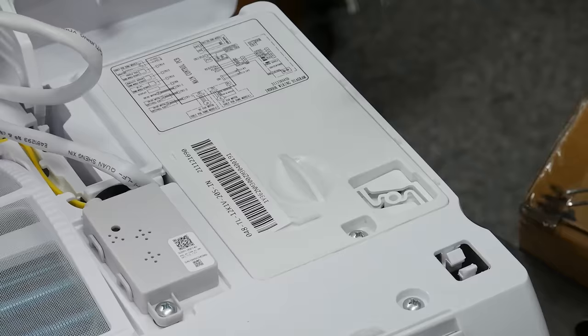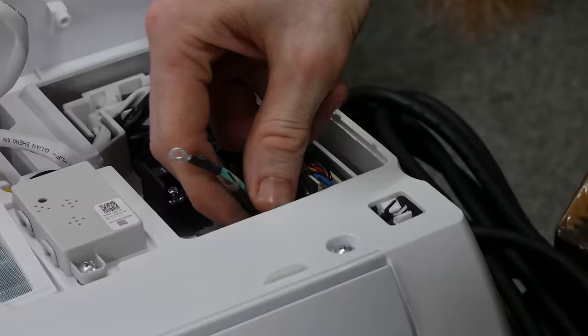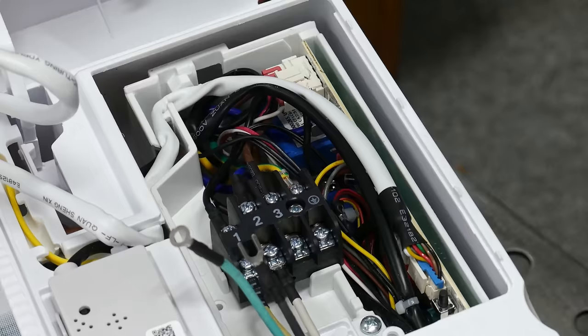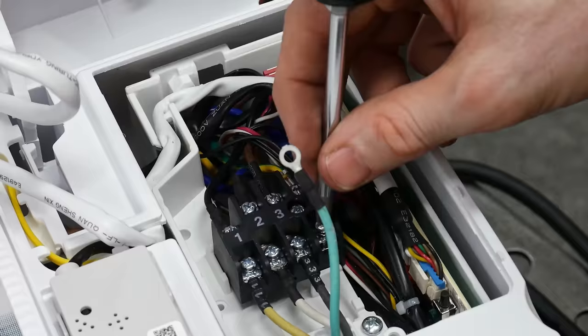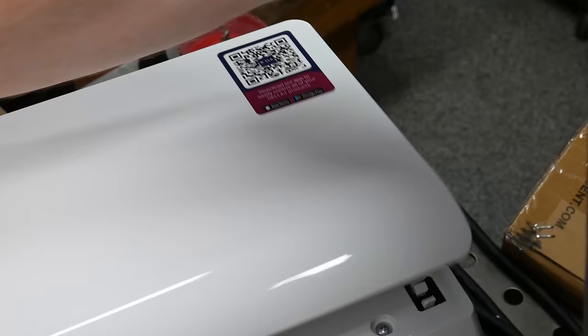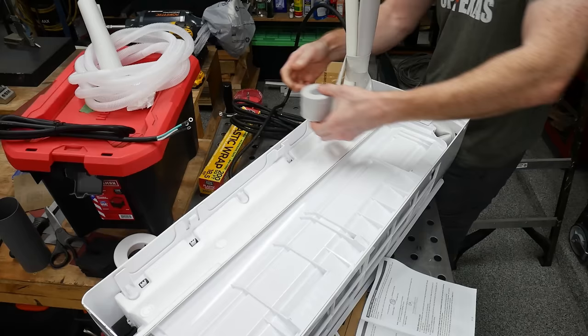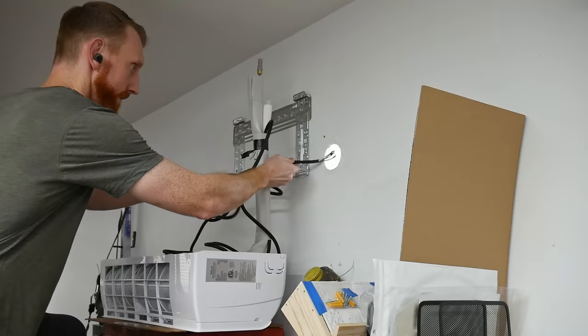Before mounting the wall unit we have to connect the wires that will run between the wall unit and the outside condenser. There is a wiring diagram on the front panel and the wires are labeled, making this a pretty easy task. The yellow wire goes to location number one, the white wire to number two, the black wire to number three, and the green to ground. With the inside unit wired, I carefully bent the refrigerant lines perpendicular to the assembly, then used the supplied HVAC wrap to wrap the two coolant lines, the electrical cable, and the drain pipe. Make sure the drain is oriented at the bottom so that it gravity drains easily.